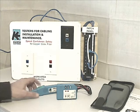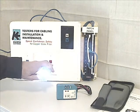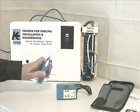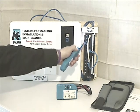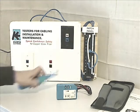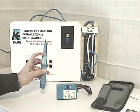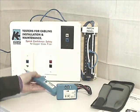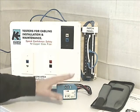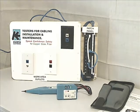The microprocessor-based Probe features a headlight — something that seems like a gadget trick, but is very important if you've ever used a device like this to find a good light to be sure what you're touching. It has a 577 Hz filter in it that turns on a light when it finds a signal at 577 Hz, such as comes from this unit or from other test equipment that's commonly found.